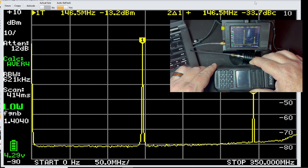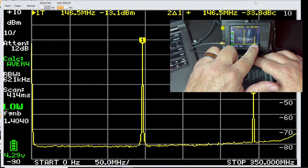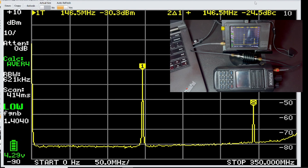Technically it's supposed to be negative 40 dB below. Here's the first harmonic and here's the second. The second is supposed to be 40 dB down, and it's really close. It came up just under the 40 dB threshold.